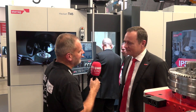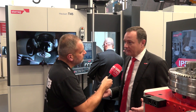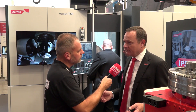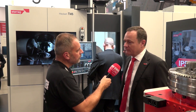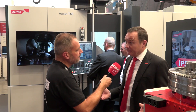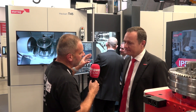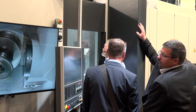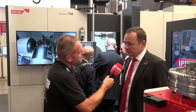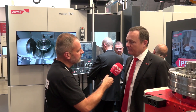The types of materials you're ideally cutting on the T45 are heavy materials and heavy cutting — like steel and cast iron — but you can also do aluminium, so it's a very versatile machine depending on the spindle you put in. These machines are built as a base model, so the build time is a lot less. Is that the same with the T45? It's the same — it comes out of the same box, it's just a variant of the same machine.